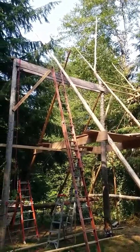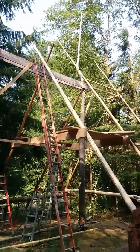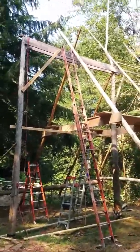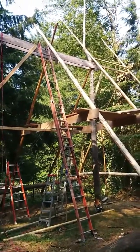The thing I like about an A-frame style greenhouse is you use the minimum amount of materials for the function of the building. The entire south side of the A's will be glazing, pointed towards the sun.